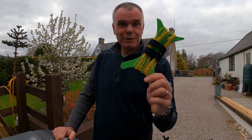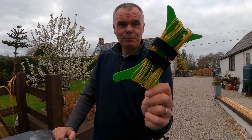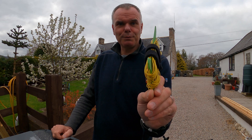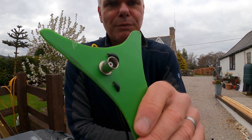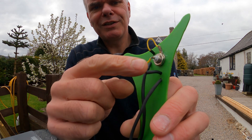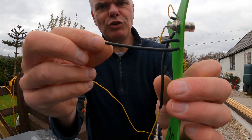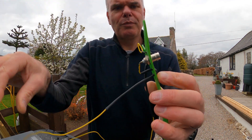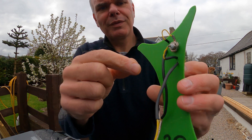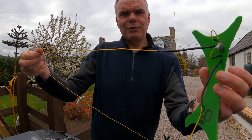The first thing is the weight — the whole lot weighs about 60 grams including a carabiner and a couple of bits of velcro. It's wound onto a very thin one-and-a-half mil bit of plastic from a flexible chopping board. I've mounted a chassis mount BNC through the section of chopping board. The radiating element is attached to the centre of that, and I've drilled a couple of holes for strain relief with a bit of heat shrink tubing so that goes up the mast. The solder tag for the shield is attached to this other wire, which again goes through some strain relief, and that's your outer counterpoise.